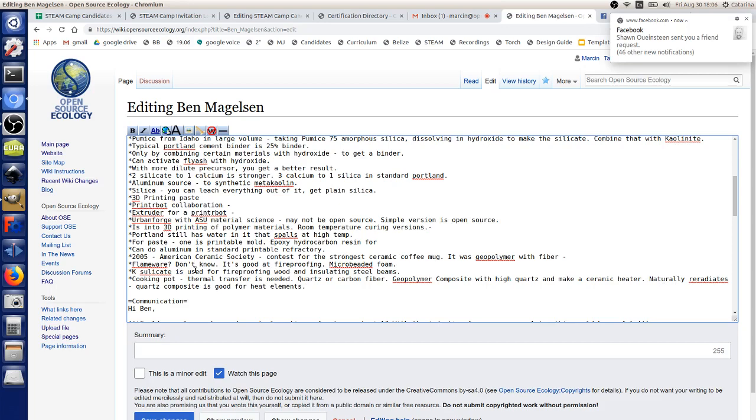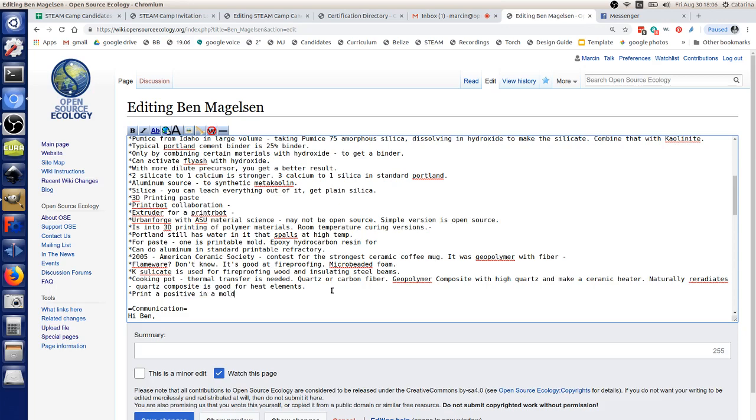For 3D printing for aluminum casting: you'd print the positive part of a mold structure using ABS, vapor-smooth it if you want, then pour the geopolymer to make the mold with it. You pull the geopolymer against the plastic positive to make the mold, remove the plastic, then pour in aluminum. You could also do it as a lost wax type process, or build two-part molds — make half mold and half positive with the FDM print, then create the geopolymer mold from the 3D print, and pour the metal into it.